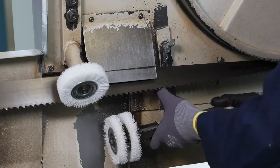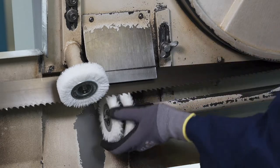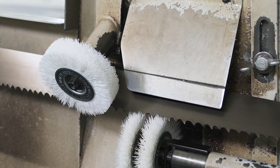When using a variable tooth pitch, we base the setting of the brush on the smallest tooth pitch so that the brush tip touches the tooth ground slightly, thereby achieving the optimal position of the brush with the highest efficiency.